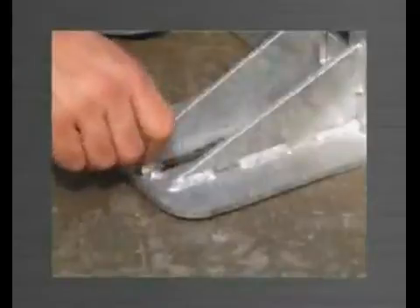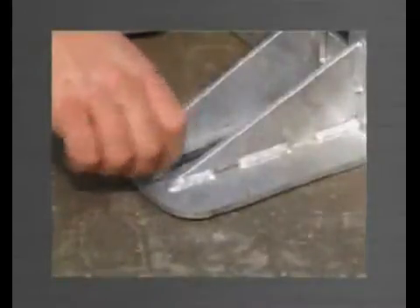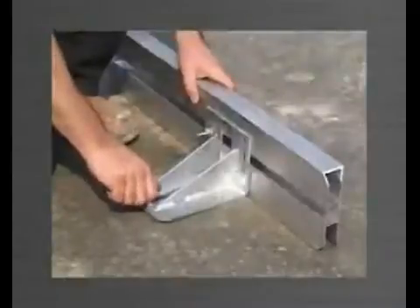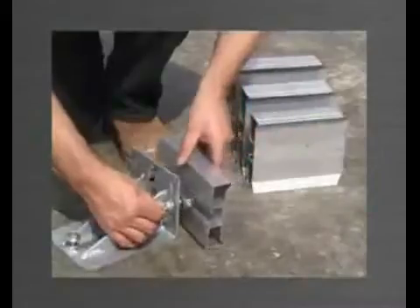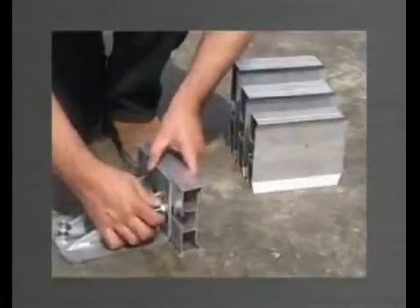The tilt adjuster raises the back of the bracket, causing the edge form to tilt until plumb. This feature is not required often, but is still provided as an option. As with all Panelware brackets, the top bracket will accommodate all four sizes of edge form.